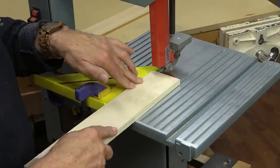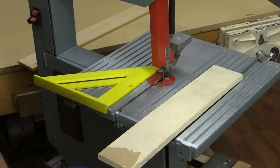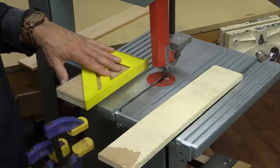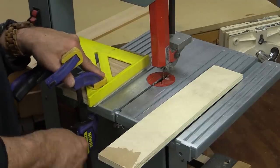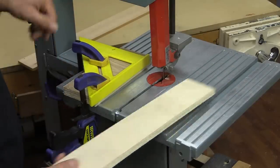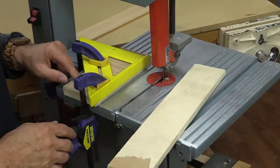You can just go ahead and cut the wood. And if you want it a little bit higher, you can put up a piece of scrap wood in there just to give it a little bit of lift, move the flatter part around, clamp that down, and now you've got an even thicker fence. So if you've got thicker or taller wood, you can use a thicker one — lots of different options using a speed square.